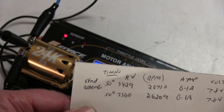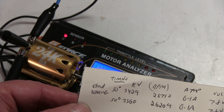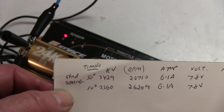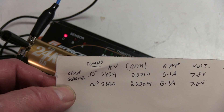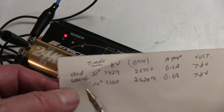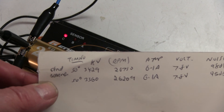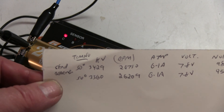So what can you say? Ceramic bearings in theory should enable the motor to rev freely, but barring a few certain errors on the sensor board, it's not quicker. The value of ceramic bearings appears to be reliability rather than outright performance.